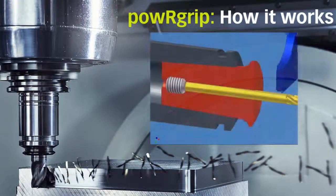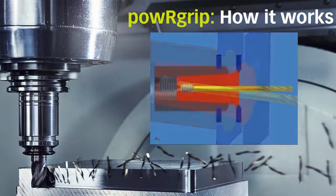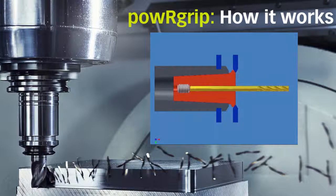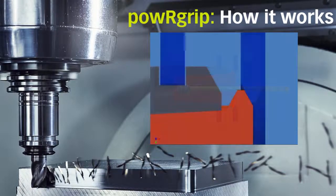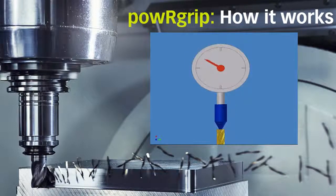The collet has a shallow self-locking taper that is pressed in with up to 9 tons of force using the PowerGrip hydraulic press. Each collet is designed with a square shoulder that, when pressed in, makes contact with the face of the tool holder. This positive stop design allows the use of the built-in backstop to accurately preset your tool length projections.